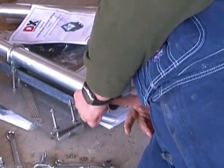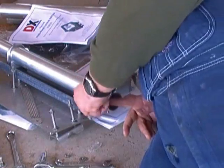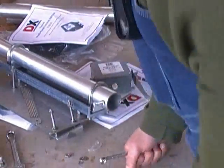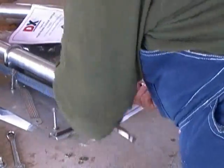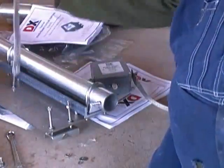There's the star washer. It goes up next to the radiating part of the antenna. Put in a nut there and tighten it down. You want to get that good and tight — not over tight, don't break the thing — but get it tight and snug. That's where a deep well socket works.